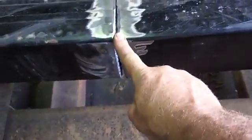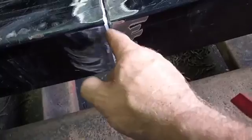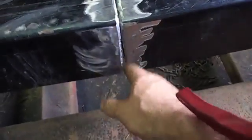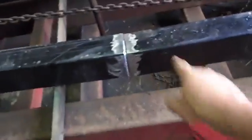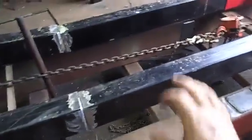We've cut the reaches out, obviously, and this is what I'm going to do a little later today. We've got it butted up against, and what I'm going to do is weld a bead across the top on both of them, and then I'm going to take that jack and jack it up and get it solid, and then weld this and that. And then I'm going to grind that black paint off of there, and put patches across that, very similar to those. And that'll be the end of that on both of those.